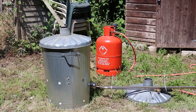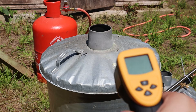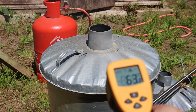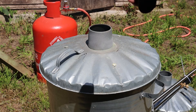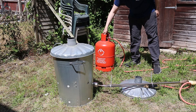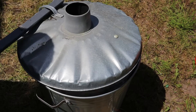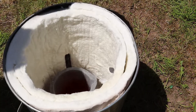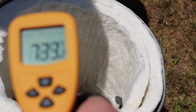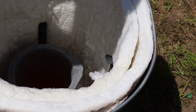The crucible needed to be tempered before use. To do this I heated it in the oven for an hour to drive the moisture out. Putting it into the new furnace I then slowly ramped the temperature up to over 800°C before leaving it to cool down again. You can see here why people on YouTube don't typically use blowtorches to heat their furnaces — there isn't enough air flow, so I had to rig my hairdryer to blow air in through the holes at the back of the torch head. This doesn't work very consistently; I think I will replace it eventually with a proper furnace burner.